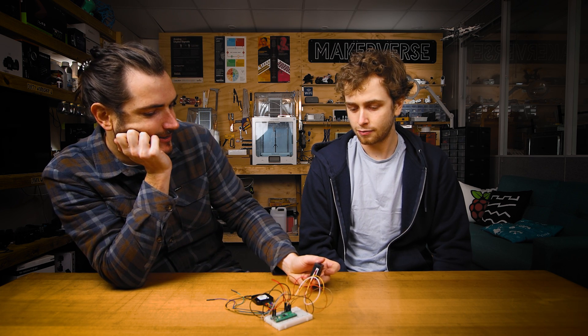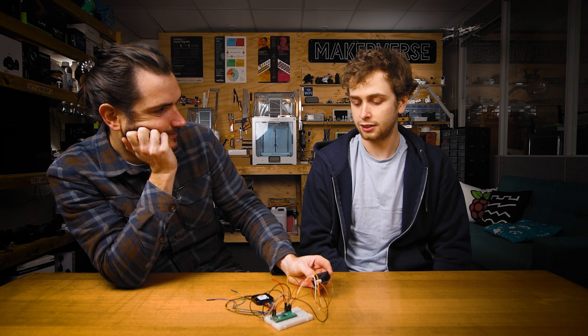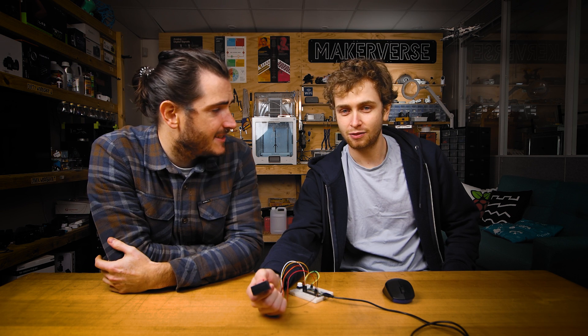SPI is super good enough for low to medium resolution, up to about five megapixels. How long does it take to get a photo? The photo capture is basically instant — there's an IC on board that captures the photo and does some pre-processing into an RGB or JPEG format. We can then read all of that off the SPI bus, which takes about three seconds for a full read depending on the file.